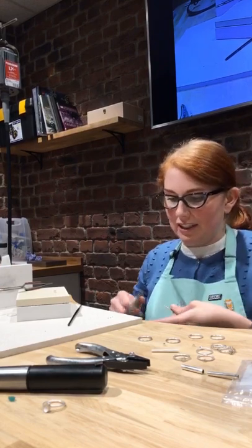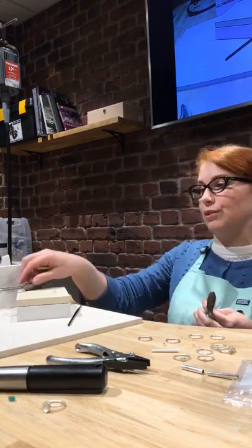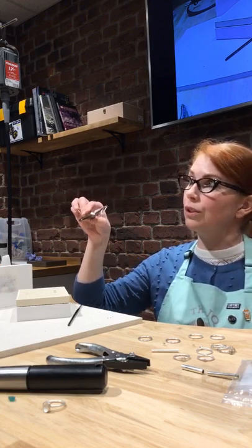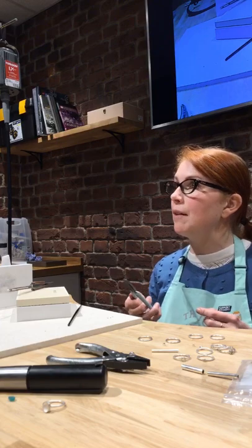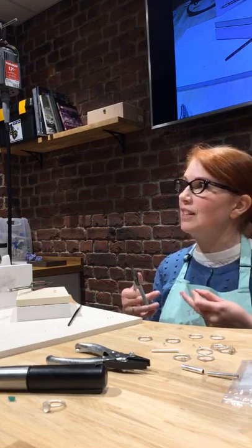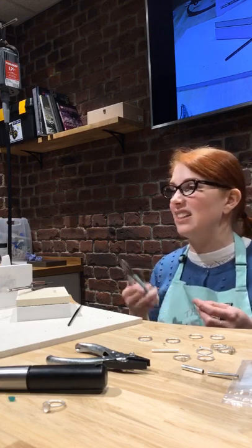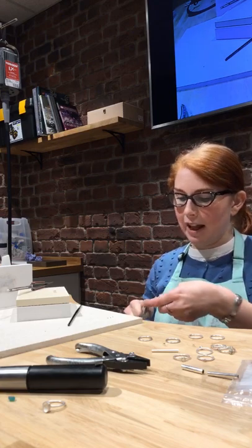Solder choice is an interesting one. In general, because my solder joint is on the other side and I'm protecting this solder joint by using my reverse action tweezers that are steel and going to keep the heat away from that solder joint, I feel like I can use hard solder again. If I was soldering really close to an existing hard solder joint, I would probably use easy. So, in general, use hard for as many solder joints as you can, because it's not harder to work with, it's actually harder, as in it lasts longer. It's less brittle, it's not as soft, and if you ever need to do a repair, that's when you drop down to easy. If you've already used easy, you've only got extra easy to go to, and extra easy is horrible. So in general, use hard solder as much as you possibly can get away with.